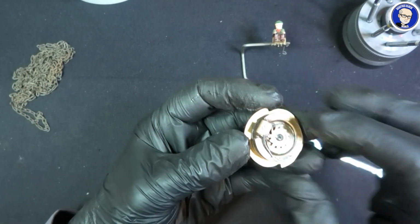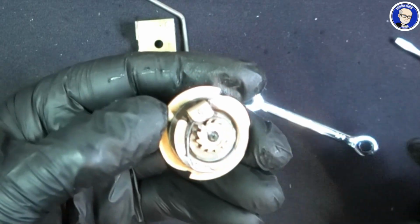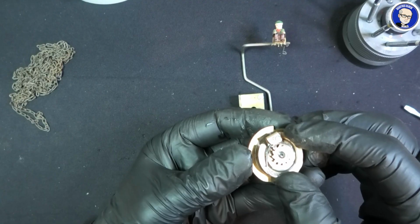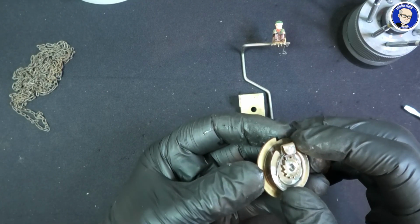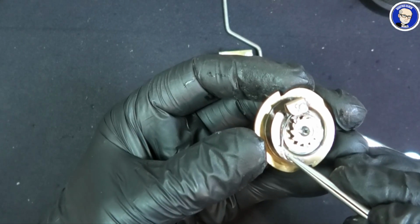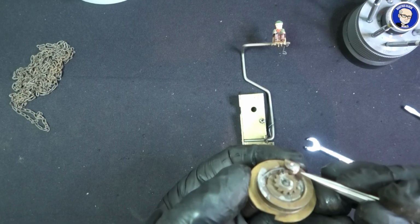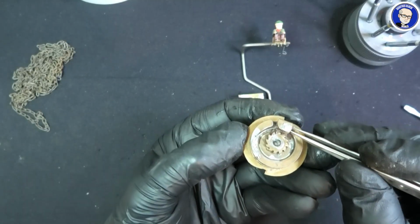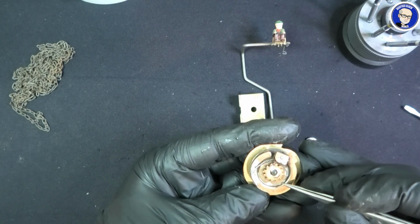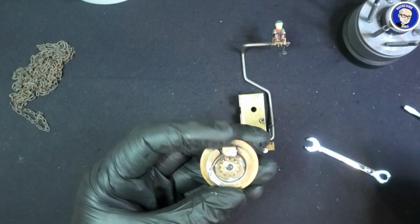Very poor quality soldering. They're using it for a click spring. It's a tiny little click in there, and as the wheel turned round, the click does drop into the ratchet, and the wire comes from here and it's been soldered on a great slab of solder up inside there. And you can see the pretty big slab of solder on there, and some of it's run down in here, so the usual bodgy type job. And there's a big chunk of solder there, and some of it's run round there. As we turn this wheel, the click drops in and out.